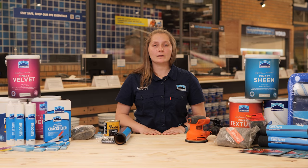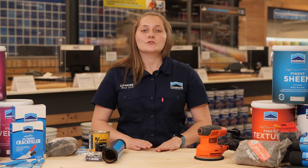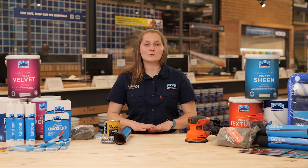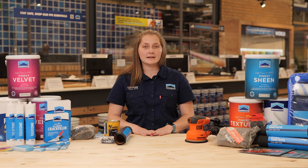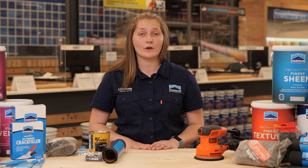If not varnish, break it down by sanding it with steel wool. Paint on a pink wood primer and then paint with any paint. Chalk paint is very popular because you can paint almost anything with it and you don't need to prepare the surface. With chalk paint you must finish off with a finishing wax sealer — if you don't, finger marks and dirt will sit on the furniture.